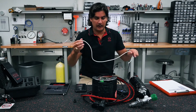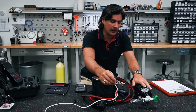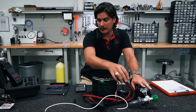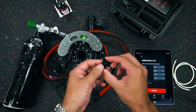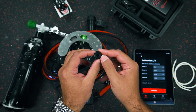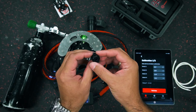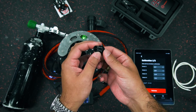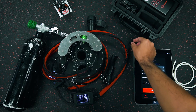The SetBlenderMax kit also has a lot of tools you can use for calibrating your Liberty rebreather, minus the jig. Then we have our Pro flow limiter, which is part of your SetBlenderMax kit. There's also a low pressure hose cap, but you'll see on the bird's eye view that you have the plug for a flow limiter here, so you can plug directly in. Usually if you have your rebreather built up, you can just unscrew one of the MAVs, plug in, and that's how you can do your calibration.